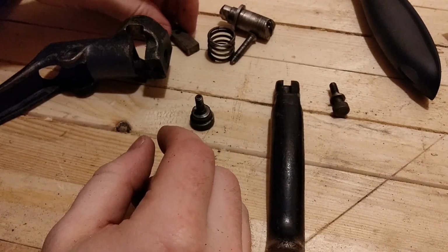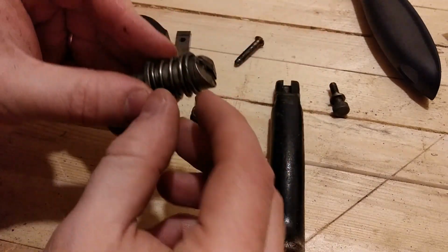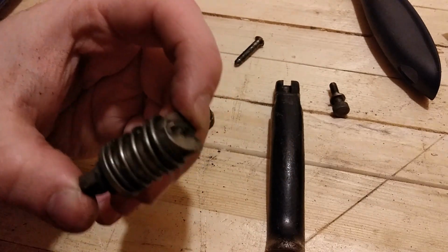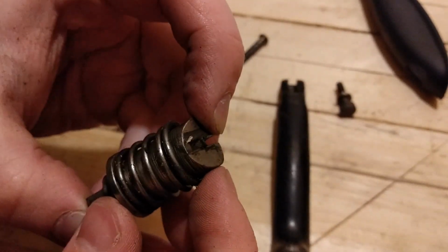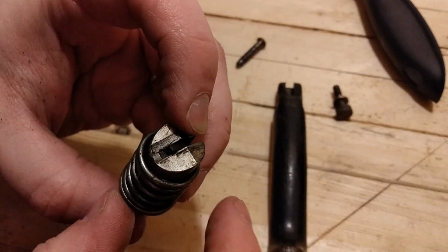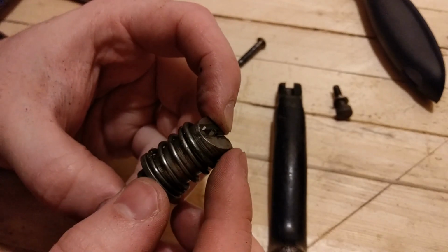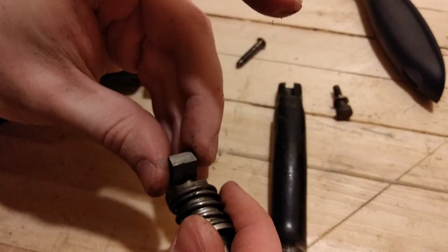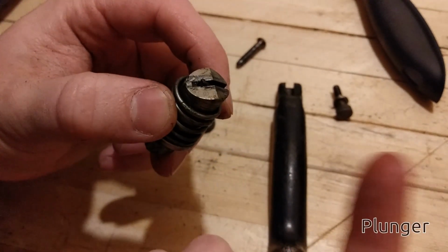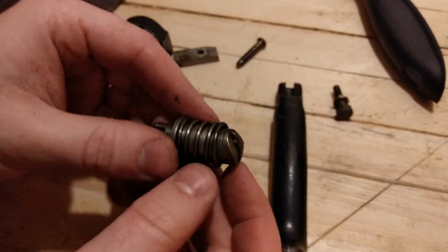Now here's the parts. Let's describe what's going on here. Well, the piece in there is called the hammer. Right there. Let's bring that close. Can she focus? Right there, that little piece of metal sticking out is what's called the hammer, and that bends the tooth of the saw over. This piece that it pushes against is called the anvil, and this piece, I forget the name of it. I'll try to put it on the screen somewhere here, but that pushes the saw plate against the anvil.